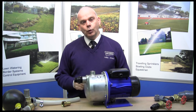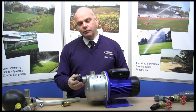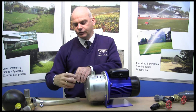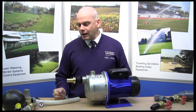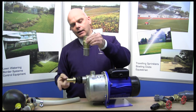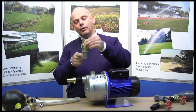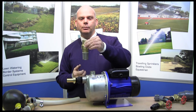If you've got an underground tank that you're taking water from, or a lake or a pond, then the inlet fittings are slightly different. Again, we fit a unit into there to give us a common size, usually one inch. We're going to use the flexible suction hose, so that goes on there, and then our flexible hose goes down to the various options. If we're coming from an underground tank, we would usually use something like this — a check valve, but this time it's got a strainer on it. Once the water starts flowing into the pump, it can't drop back down and go back to the tank. This pipe from here up to the pump remains full of water, so it remains flooded — that's most important.